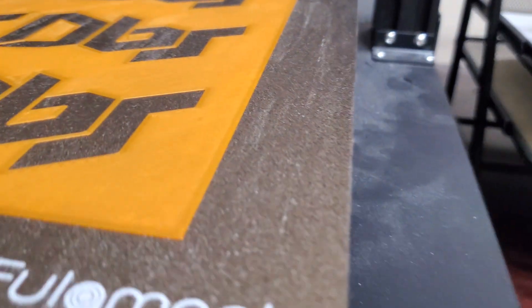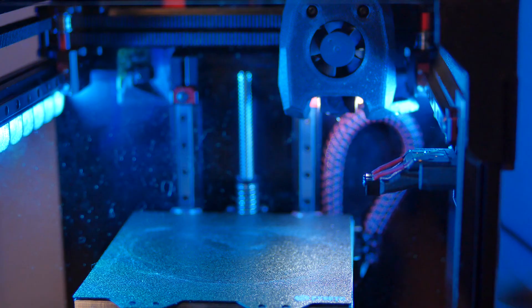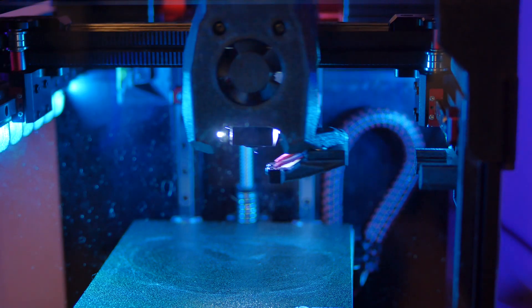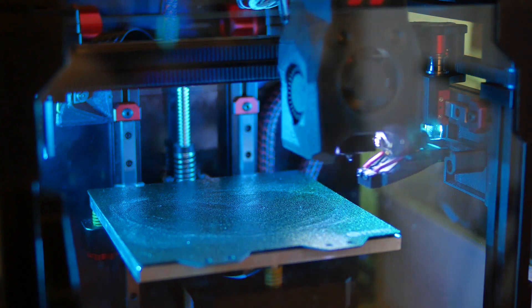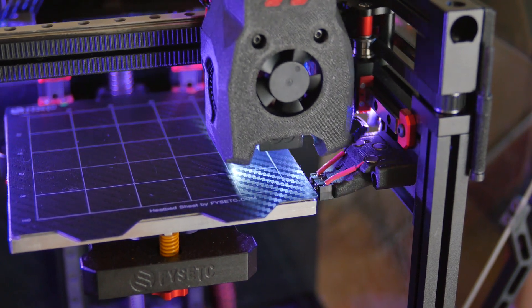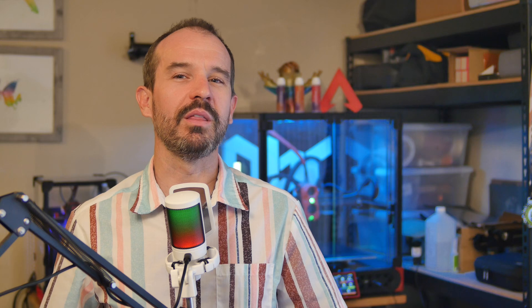The capacitive probe is also kind of slow, but of the four types I've used it seems to give the most consistent results, and having no moving parts is a plus. The Clicky probe on my Voron V0.2 has been a little temperamental, but I think most of that was due to a wire that got kinked leading to my CAN bus tool head, which I've since resolved. There are a bunch of small connections I could see becoming a problem in the future. It does work, and it's satisfying to watch the printhead dock and undock the probe, though it's possible for the tool head to dislodge the probe from its dock when passing that corner.